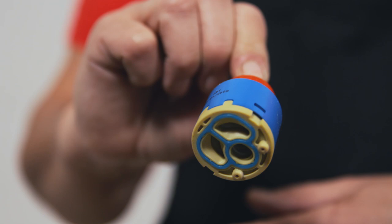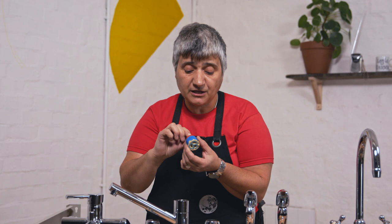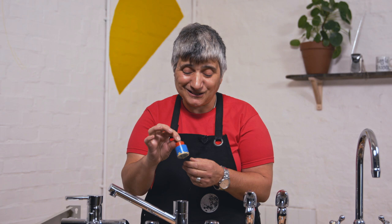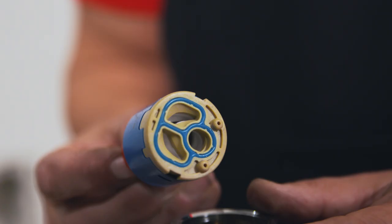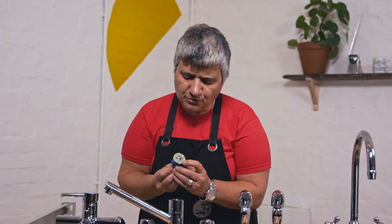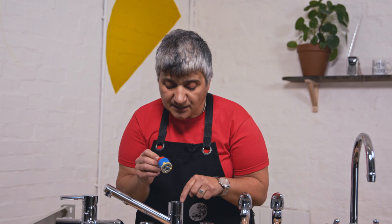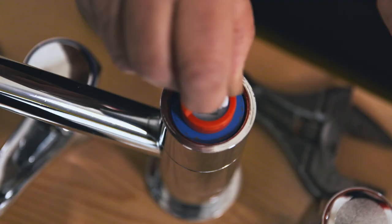You'll see there's a pattern of a rubber washer under there. There are hundreds of different types of these on the market so you must take this to your plumber's merchant — not a DIY shop, a plumber's merchant — and they may have one of these in stock. If not, there's an ID number on there that you can use to find one from the internet. You'll also notice under here that there are two lugs. They will help you to relocate the cartridge back into the body correctly, because in the tap body there are two holes and that locates into there.